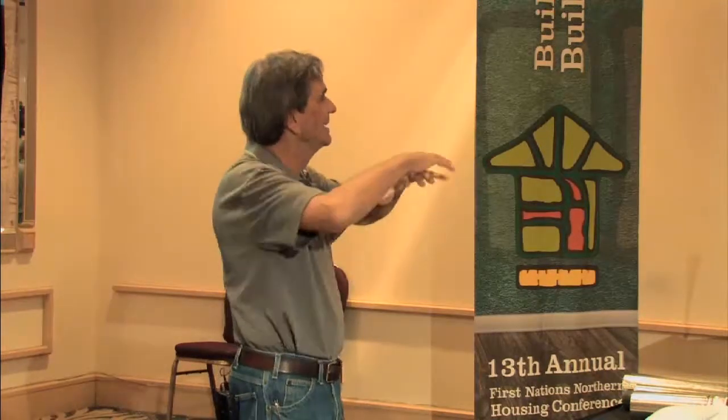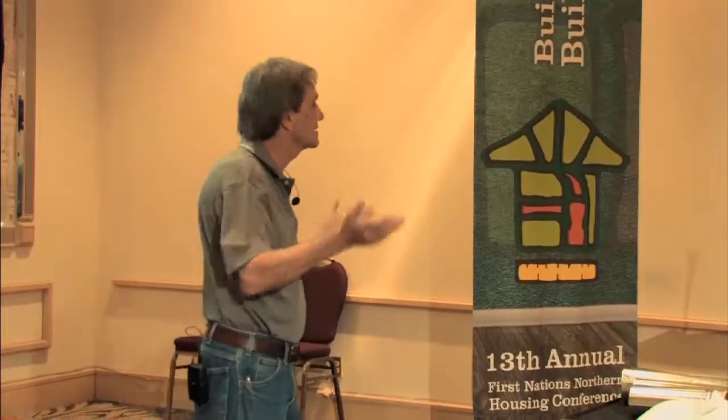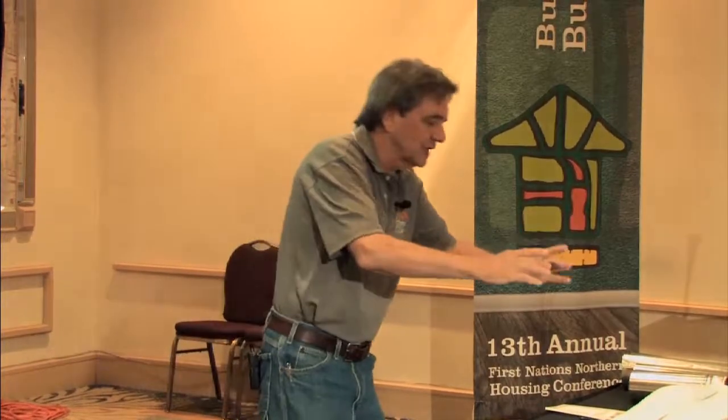And when you get it right in the heating season, you take a black felt marker and you draw a line on the duct where the handle's pointing, and you say, winter. And then you do it all over in the summertime. In the summertime, you'll find they're in different positions. When you finally get every room as comfortable as you can get, particularly if you've got air conditioning, you'll mark that summer. And once you've done this for one whole year, then every year when you turn on the heat or the air conditioning, you just go down and change all the dampers to line up. And you'll find you're really close to a comfortable situation without trying to second guess it all the time.